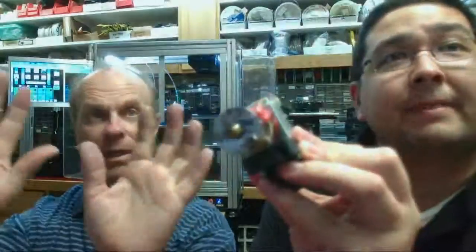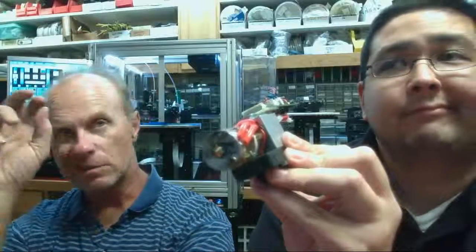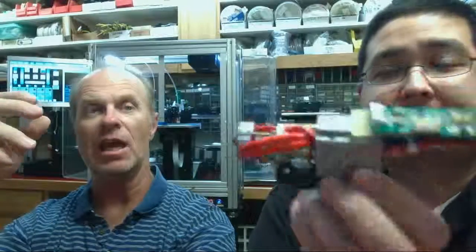As you can see, you don't take it out to clean it — it's cleaned in place. Just brush it lightly. If the tip's not clean, residual plastic will catch other plastic or char, eventually making the surface sticky. You want it smooth because it actually planes across and levels the plastic during an extrude, leaving a beautiful finish with a clean tip. A dirty tip doesn't look so good.